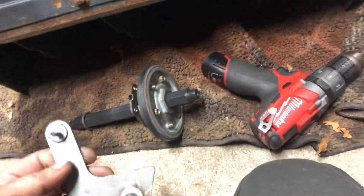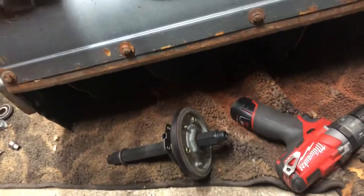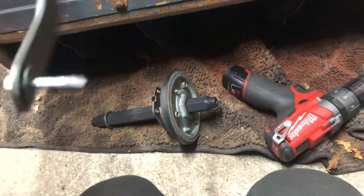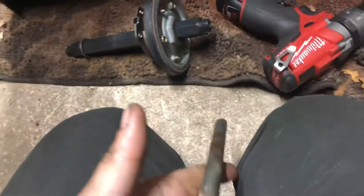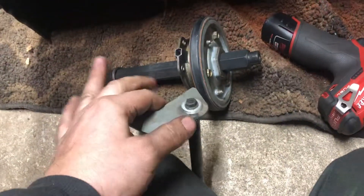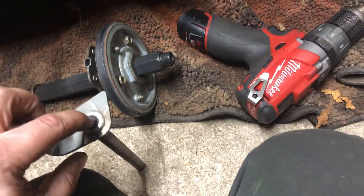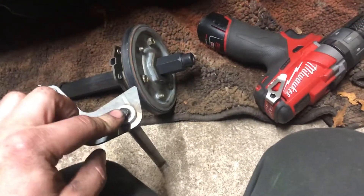The next thing I did was flip this shaft so it hangs on the correct side. Originally it was the other way, now we're flipping it to this side. I ground it down to a flat surface because there was a weld there. Then I ran my drill — I kind of eyeballed it. I used an automatic center punch first to make sure when I drill, I'm drilling straight and my drill is not drifting.